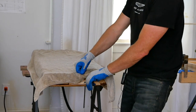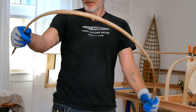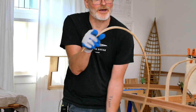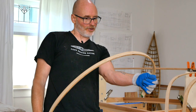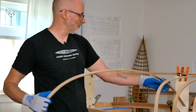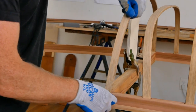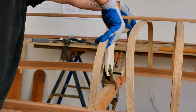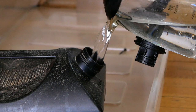We're coming up to the middle of the boat now, and this is as far as I'm going to demonstrate because the back half is exactly the same. Rib number 16 — I'm seeing a little bad grain on this corner, so I'm paying extra careful attention. Anytime the grain is crossing the edge of the wood, it's more likely to split. I'm going to put this in the middle of the canoe — it's an even-numbered rib so I flip it the opposite way. As soon as I'm done with this rib, I'm going to run to the other room to grab the kettle of boiling water, because my steam box is starting to run out and I don't want it to interrupt my steaming cycle.